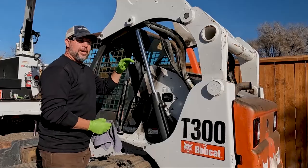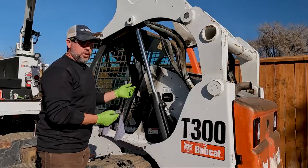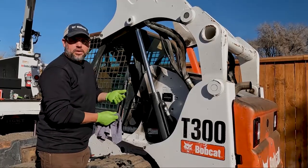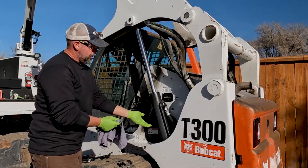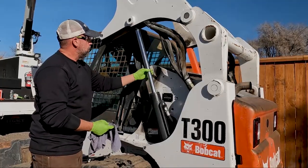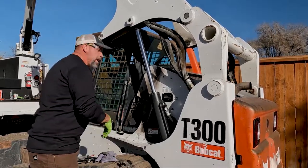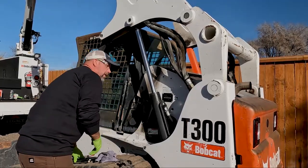That's basically how you do it. This is about a 35 to 45 minute job per side. This is a G series machine but the process works for everything from the old 773s, F series, G series, even M series machines — it's basically the same process. You don't really ever have to pull these cylinders out unless there's a problem with the barrel itself; I always just pull the rod out the top, reseal it, and put it back in. Thanks for watching — if this helped you, please give it a thumbs up so I can continue giving you quality videos.